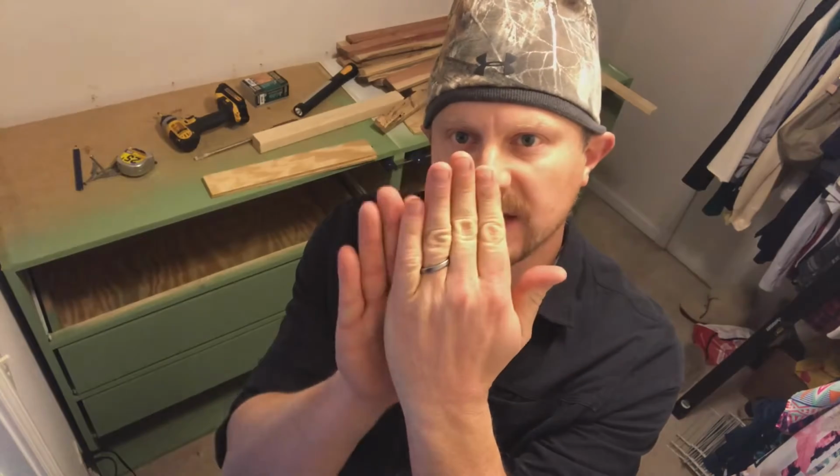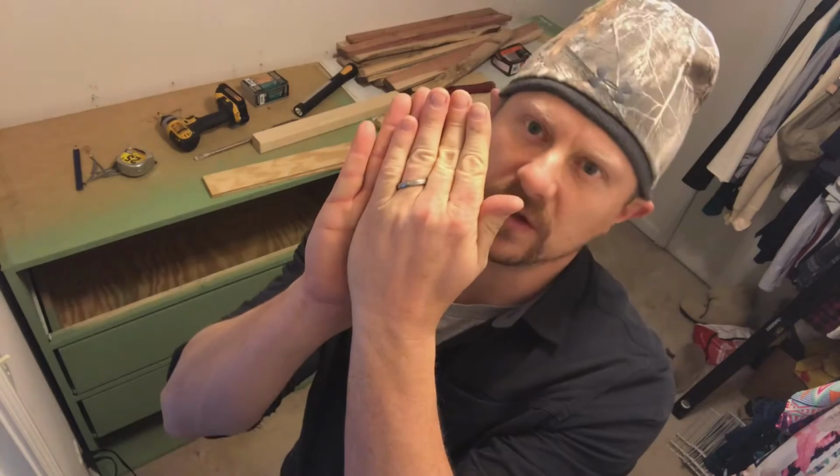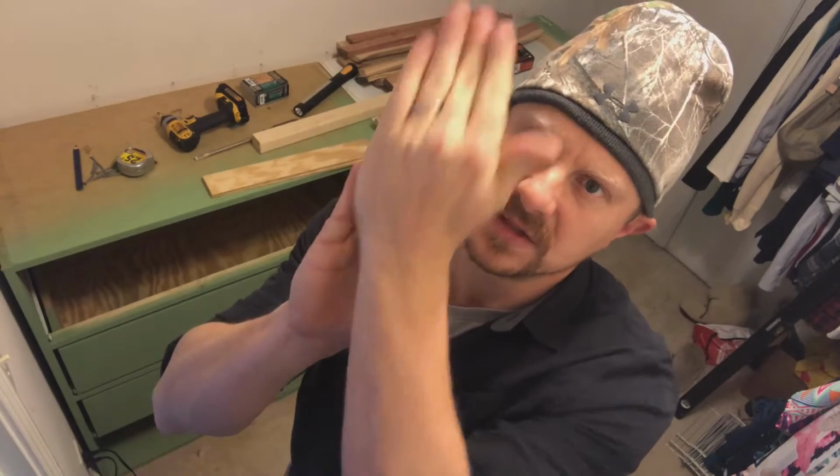So for example, let's assume that this is what I'm going to cover it with. The gap between the wall and the unit isn't skewed like this so that your reveal looks like that. You can see there's a little bit more covered, a little bit less covered. So you have a uniform reveal, okay, top to bottom.